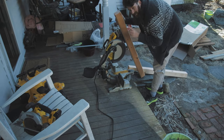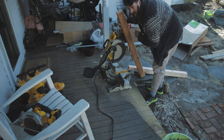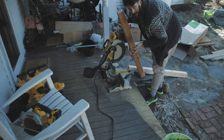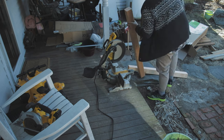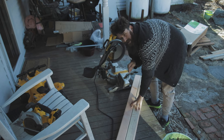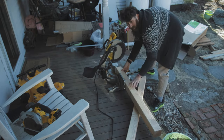Now that I've had to make that correction, I'm going to remeasure this shorter piece of wood because I had to cut off about an extra half-inch to fix the bad cut — that's going to let me know how much shorter I need to make that piece. So the table's going to be an inch less wide than I intended, but these are the things that happen when you're winging it. Oddly, they're already the exact same length — I just need to clean up the bad cut on one end. Even after goofing those cuts up, it's not like you need to redesign the table. It just means it's going to be a little more narrow by an inch or two, which means there's going to be a little bit of overhang on the center. If we want to, we can clean that up, but it should be fine.